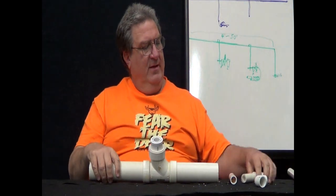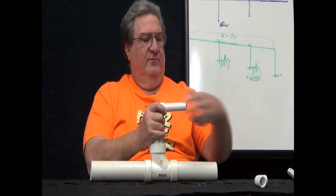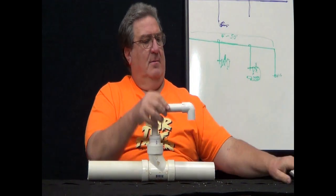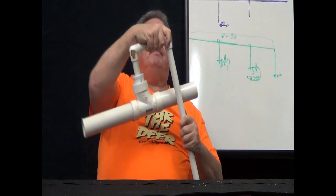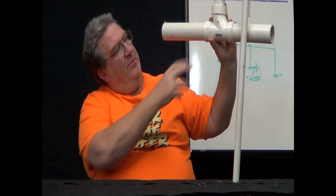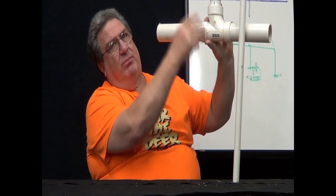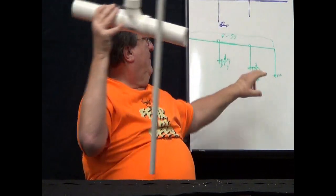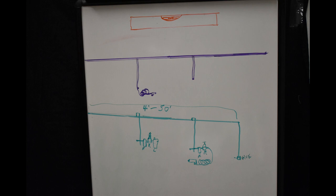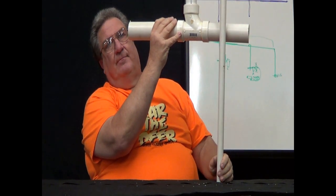The right way to cure that is to take an elbow and a sleeve, go up, over, and down for your drop. The water that's in your main line — gravity doesn't just blow it up out of there. It will stay in there and end up over at your drain. You get a better quality, drier air going down to your tool. That's mistake number two, and that's how to rectify it.